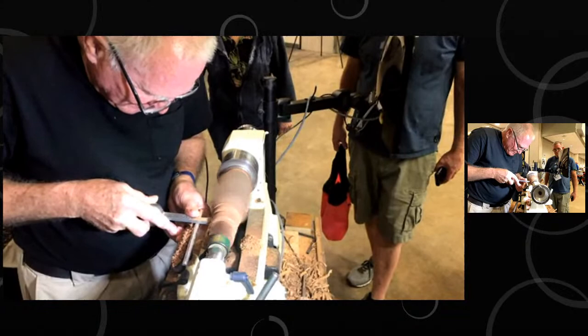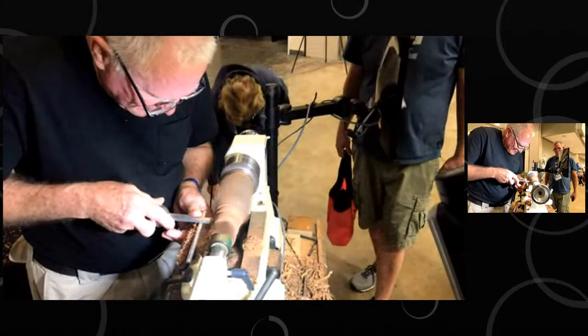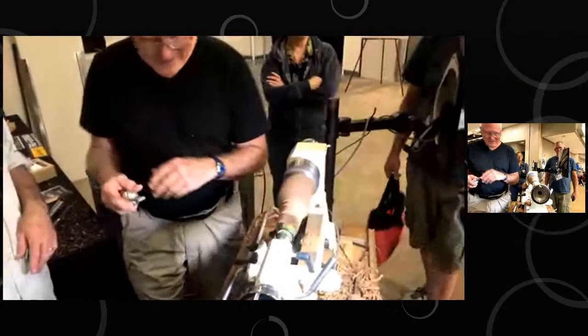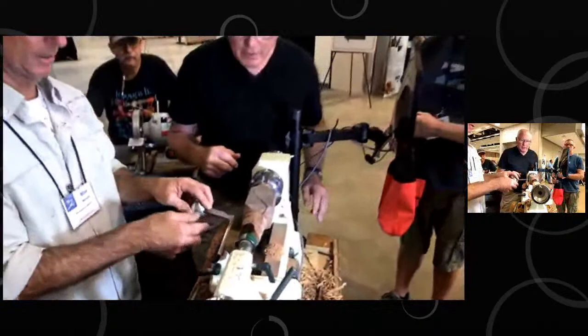Is that a little bit fast on the lathe speed for that? No. That's as slow as we go. Typically through 300? About 350 at that size. That's kind of my sweet spot. I've gone down to like 200, and this starts getting a little weird. Getting drunk. Yes. So you did pretty good there. That's a good challenge to put that wall in, because typically that wall is even bigger. And if the wall was bigger, that's what the whale tail's for, because you could sneak it back in here and knock down those diameters.